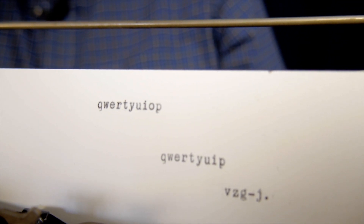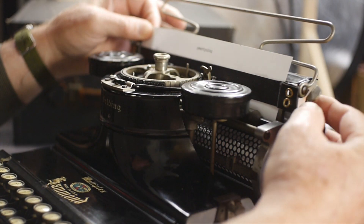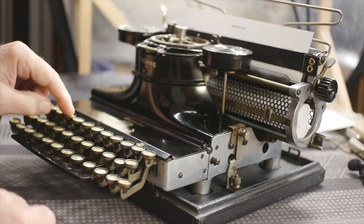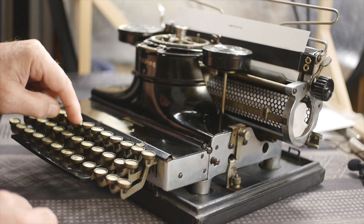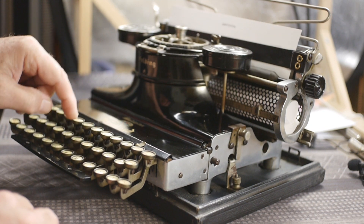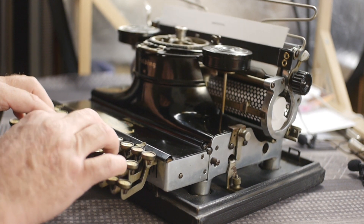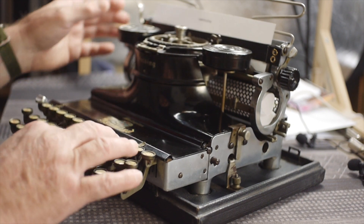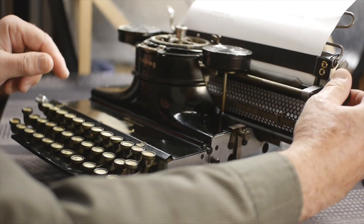I was just amazed by how clean the type looks — the printing is very nice. What I really like about this machine is the fact that the imprint force is independent of your finger force, so it doesn't matter if you hit the keys hard or soft. It's a spring-loaded hammer that's hitting from behind, and it's just a wonderful concept. You can just sit here and lightly press the keys, and as long as you give it enough force to operate the mechanism and trip the escapement, it prints the same force all the time. It's so different from any other kind of typewriter.